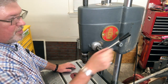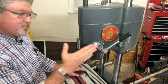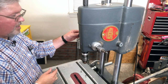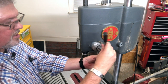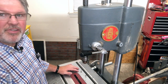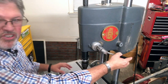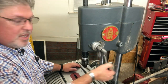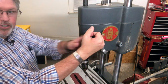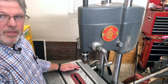Tip number three: I can put this quill handle on either side of the headstock. Being right-handed, I usually leave it on this side. There are three different dimples here that I can index that handle into, and wherever is most convenient for me — I usually try to set my table and my headstock up so that when I'm drilling, I don't have to go all the way around and be pushing up at the point where the drilling action is taking place. You can position that handle so that the travel puts you in a position where you're pulling downward. You can also accomplish that by setting the depth or the position properly with the length of drill bit that you're using.